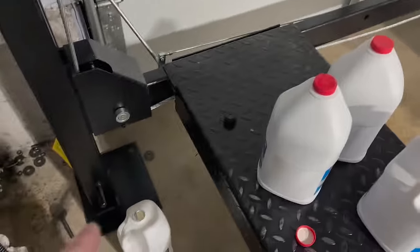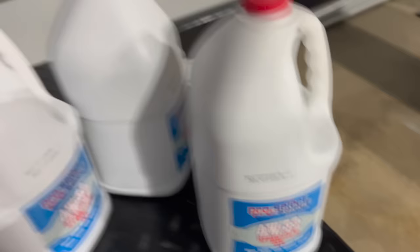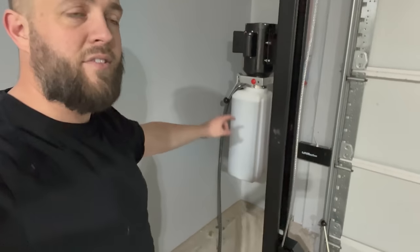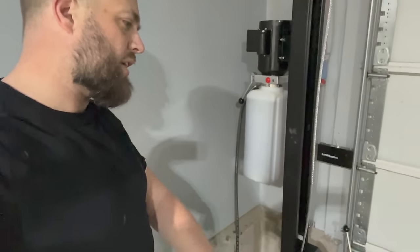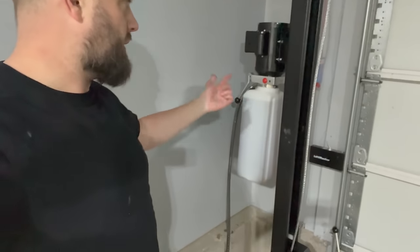We are losing light. We're going to put in four gallons of AW32 hydraulic oil — I already put in one. We're going to move on up. This is three gallons; the system has nothing in it yet, so I'm going to run the three, start it, move it, and that'll get the system full. Then we'll put the fourth gallon in.